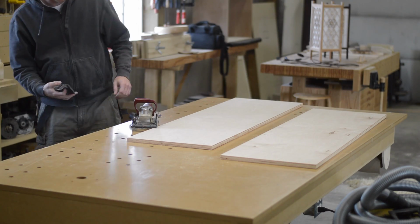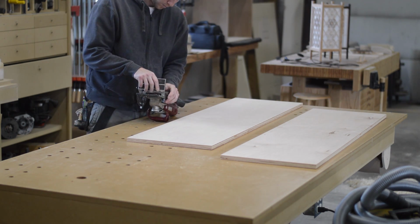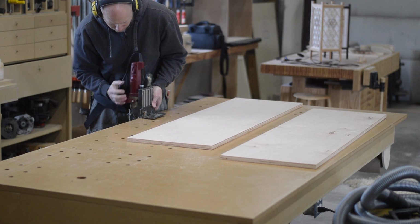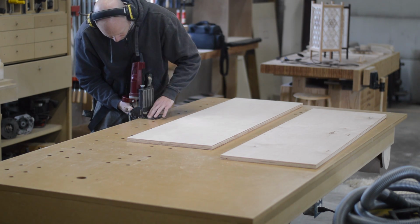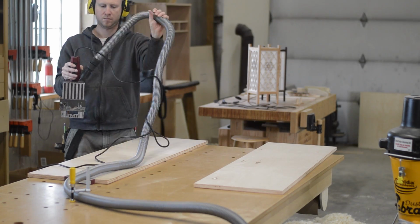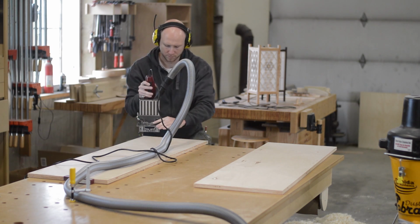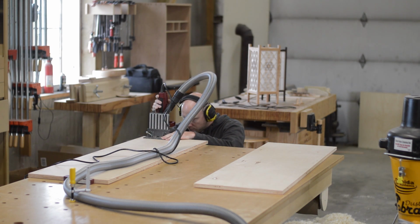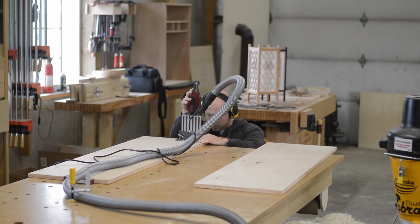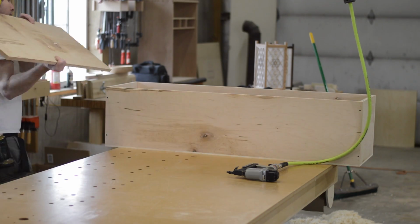Here I'm attaching an additional fence to the biscuit joiner, and it helps balance the tool when you're using it in a vertical orientation or when you're using it on narrow stock. And I attach the bottoms in the same way with biscuits, glue, screws, and nails. So if you've noticed the two interesting looking lanterns over my shoulder and you want to know more about how I built them, take a look at my channel and you'll find a build video.